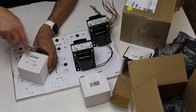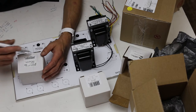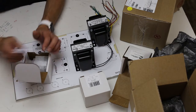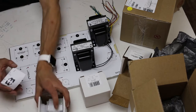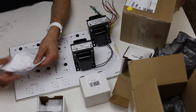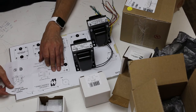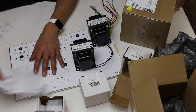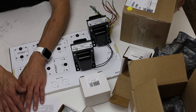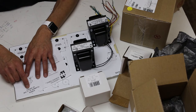Let's get to the 24 volt transformer, which is the 167L24. If in doubt, here's a nice little diagram: black-black is primary, green-green is secondary, green-yellow is center tap. You can always reference this, and this applies to the entire 167 series.